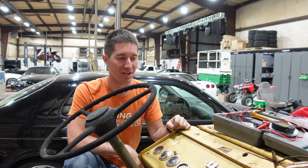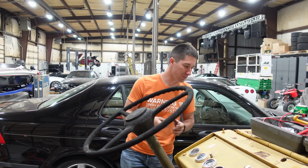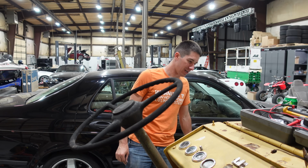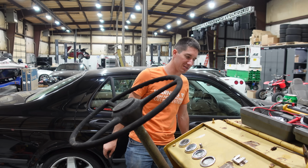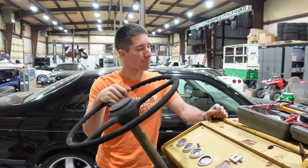Anyway, this thing is looking way, way better. That's a lot of a restoration in one day. And soon, we'll have it running again. We just need to get it some fuel supply and probably... Oh, no, we know the carburetor works. I was like, man, we got to do the carburetor. But honestly, I was feeding fuel directly into the float bowl, and it was running. So we do have a lot more stuff to replace. All the fuel lines need replaced, but it's gonna run.